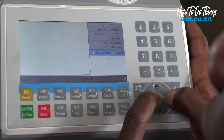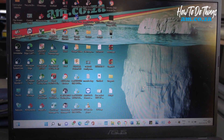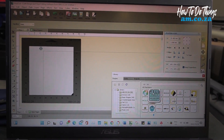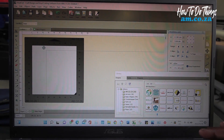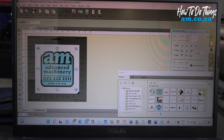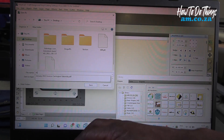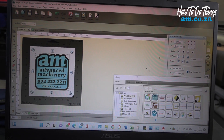I need to mark my origin. From here on, we go to the PC. I'm going to do a quick file using a template from one of our softwares for the vinyl cutters — it's a vectorizing software. I'll go to the library, pick something out, resize it to 60 and adjust it proportionally to page, centralize it, and export my file as a PLT called "jar" with the plot origin of bottom right.